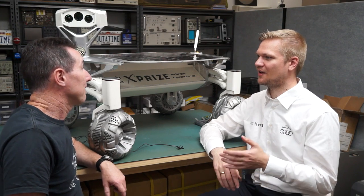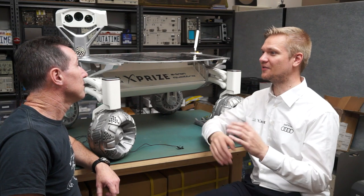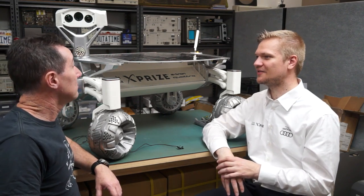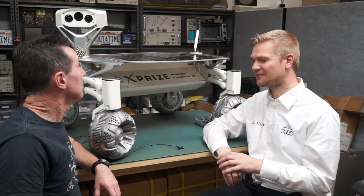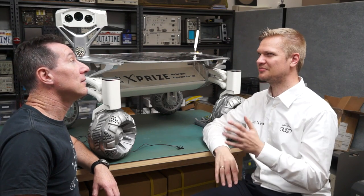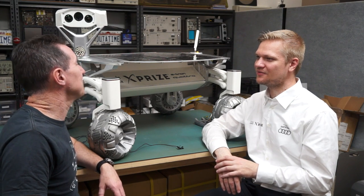with latchup, there are some pretty nice chips which can actually completely deal with it. Oh, are there? Yeah. What is it? FD2020, for example. Okay, something like this. So you've got some dedicated hardware in there to prevent SCR latchup.